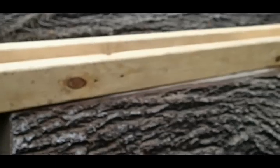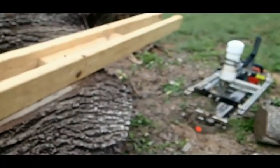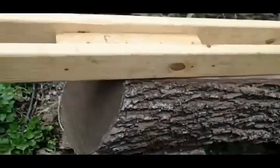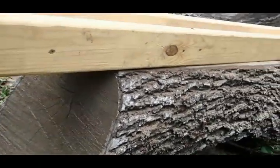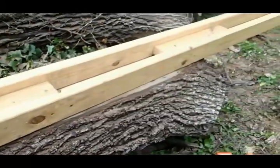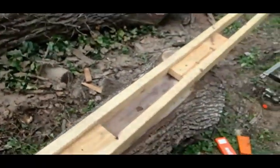Okay, I got that first cut off for a nice level, but again, because it drops off quite a bit at the very end, I decided to put it back on again, and I'm going to set the mill to go down about 1.5 inches, and that should still be a little bit above the pith. And by then we should see some grain. Right now, no fancy grain showing yet, but some nice typical purples from walnut.